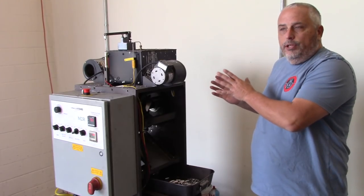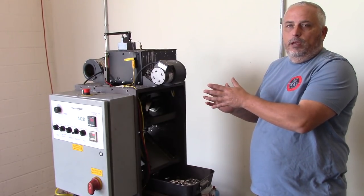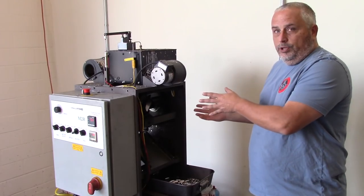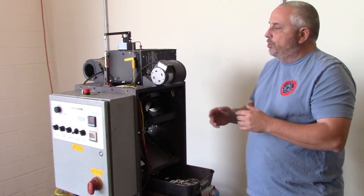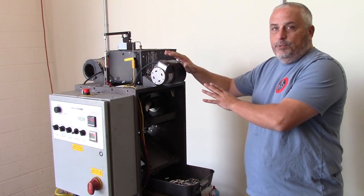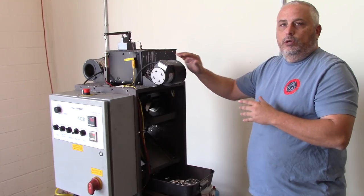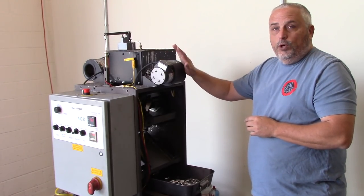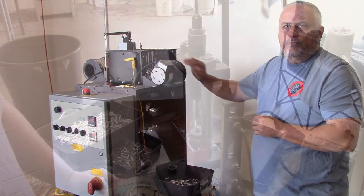So technically the first step of making a swage bullet is getting your core. Whether you get that from wire or you cast it, whatever your procedure is, for big bore bullets, we first make a core from a cast machine. When it goes onto our high speed machine, we use lead wire that feeds it. But for big bore, everything is made first with a cast core. Good? Yeah.